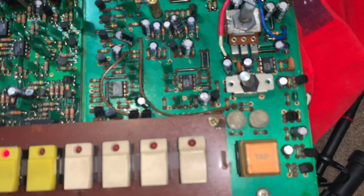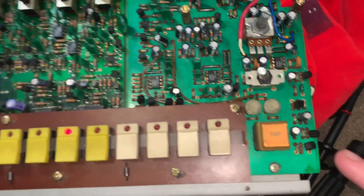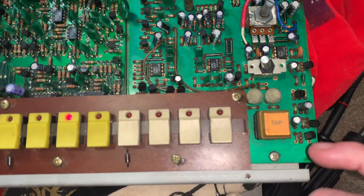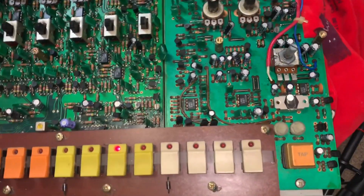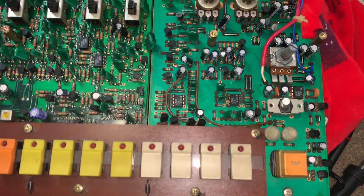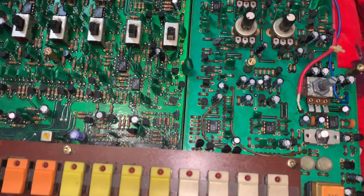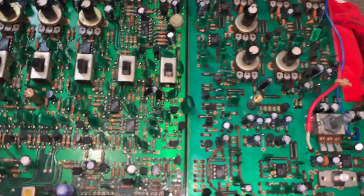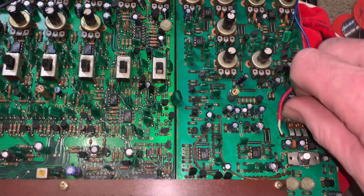The good news is it wasn't any of these transistors. I used my Crow as a signal generator, which outputs a sine wave, and touched it on the legs of each transistor. Listening through headphones, I could hear the sine wave coming through each transistor, confirming they were all working fine. Then I started fiddling with the volume knob and found a spot where I could get it to work. So it was a dirty volume pot. I sprayed it out with isopropyl alcohol and now it turns really nicely — no more gunk in there.